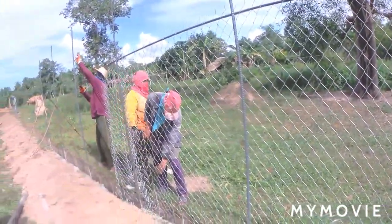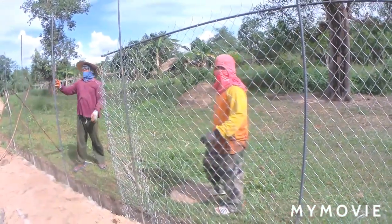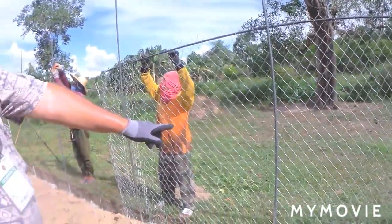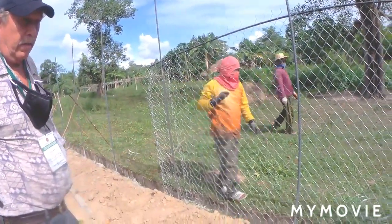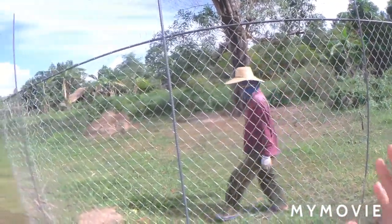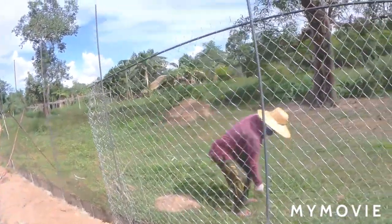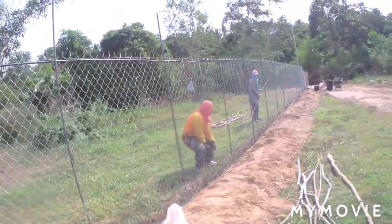We're gonna paint it with anti-rust red primer. So this is GC guys, and that is my dad over there. Randy is over there holding the rebar — every meter and a half is 20mm rebar. Between sections it's 16mm on the top, and every three meters is 20mm rebar, in the middle is 16mm, and on the top is 16mm also, and down below is 9mm.